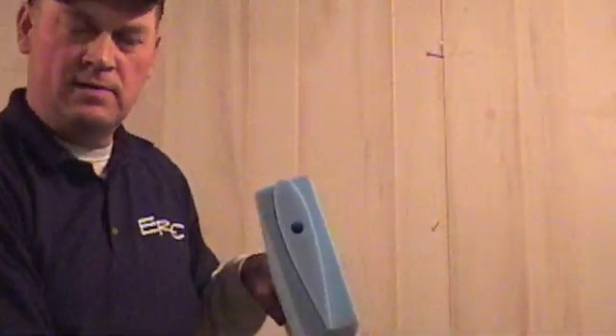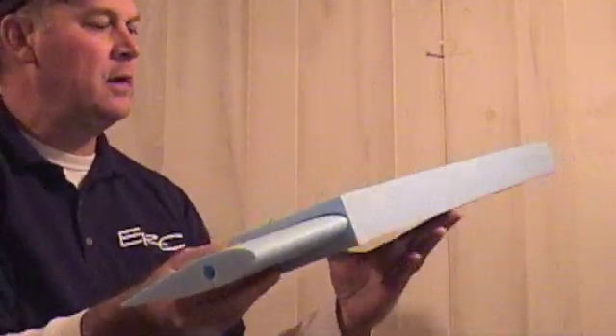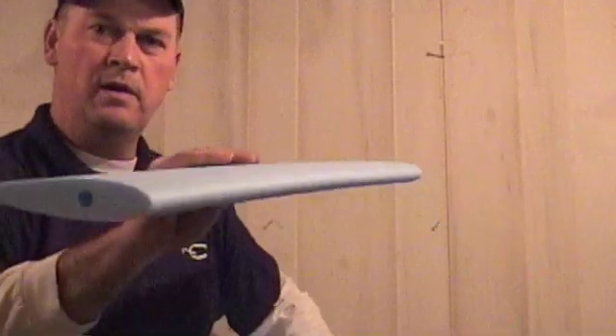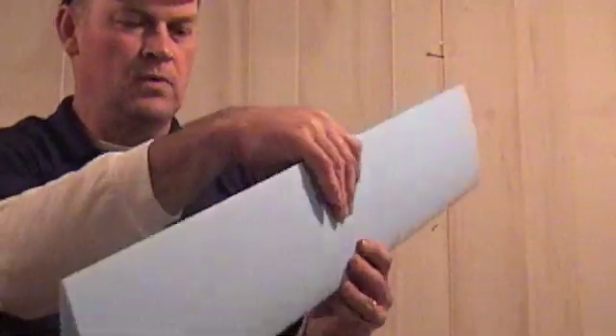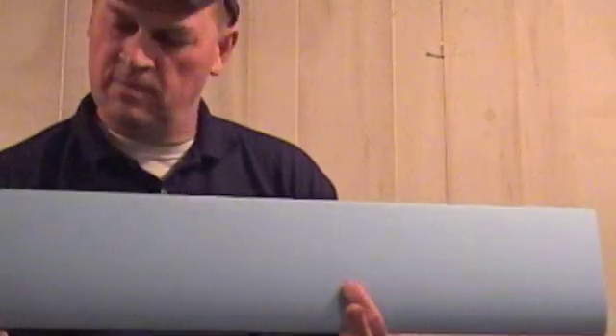Basically we've got these on the wings, and the wings are all cut by a CNC machine. We get these wings cut — they're CNC cut, and they come like this. This is a special kind of foam called spider foam; it's used for surfboards. Basically it's a foam that has a vertically oriented grain, which makes it a lot stronger. This is where we slide our aluminum spar, and that aluminum spar is going to pick up on two spots on our rotor arms.